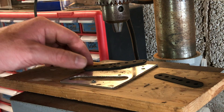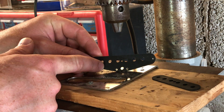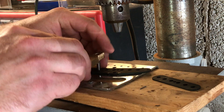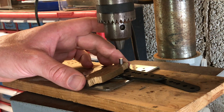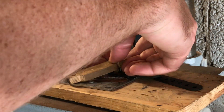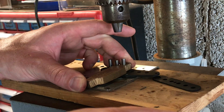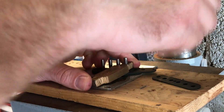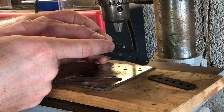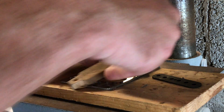We're using a drill press with the jaws closed to press the magnets into the bobbin. The first one going in is the 0.671 inch pole. I have a wooden tool to hold the pole piece in place. Next is another 0.671 inch for another string, then 0.710 inch for the D string, another 0.710 for the G string. I have the eyelet part on the bottom of the pickup where the coil won't be, so the top is smooth. Then 0.630 for the B string.